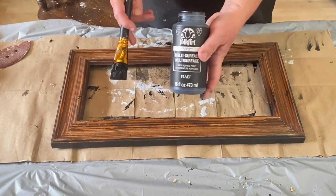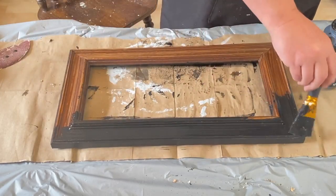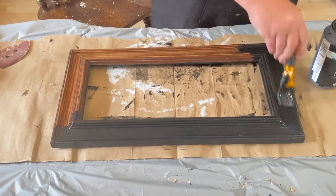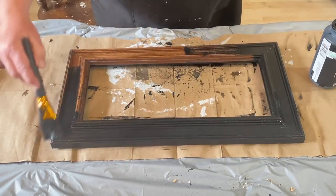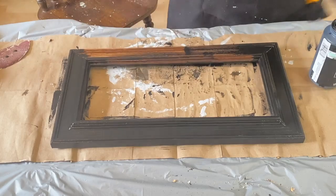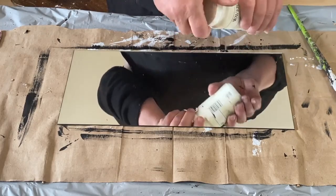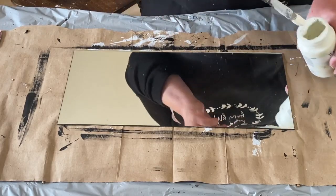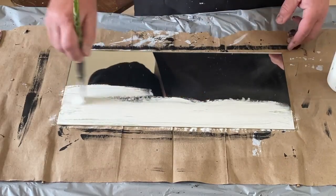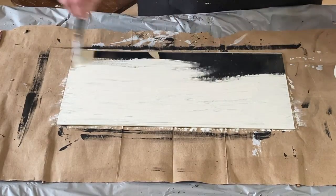I also pulled out the staples holding the mirror in. I used my heat gun to get all the paper and cardboard stuck to the back of the frame, heating it up and scraping it off. I painted the back with black folk art paint and then sealed it. For the front I gave it a little sand because the water had gotten to the frame too, making it chippy and bubbly — I wanted to get anything loose off. I only did one coat of the folk art paint since it's nice and thick and covers well. Then I took my plaster Waverly paint and gave the mirror two coats since it didn't cover as well as I wanted with one.